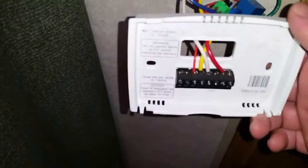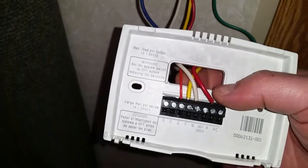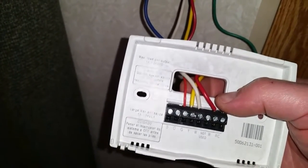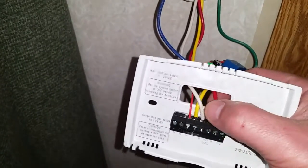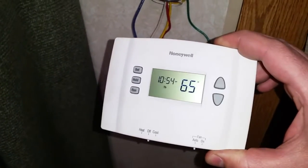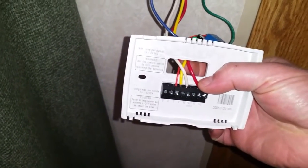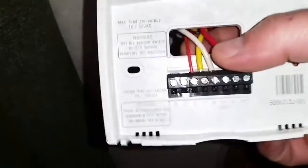We'll go over the wiring — this is standard thermostat wiring. The yellow wire goes up to the compressor and starts it. This small red wire here — picture it as a green wire; I didn't have any green, that's why it's red — is the 12 volts that kicks on your fan motor. You have 12 volts positive coming in, and your thermostat acts like a smart relay. When it knows you want air conditioning, it relays that 12 volts to the yellow wire for the compressor and to the green wire for the fan.